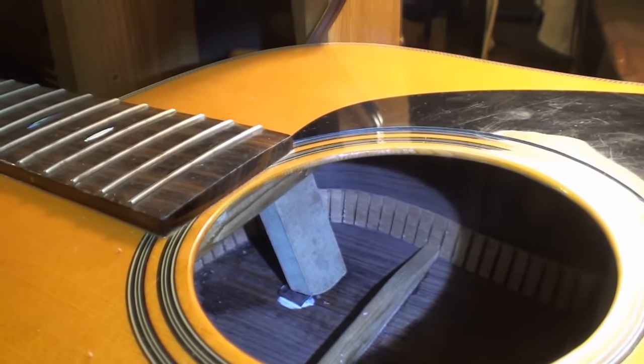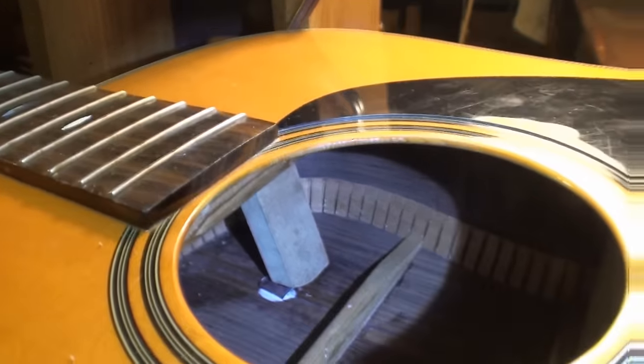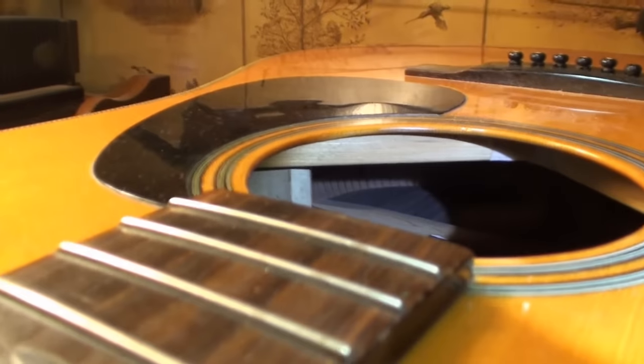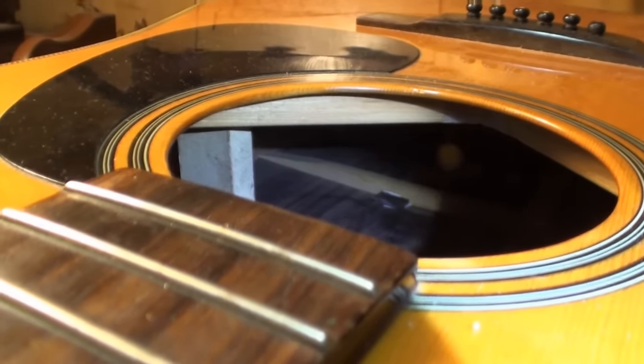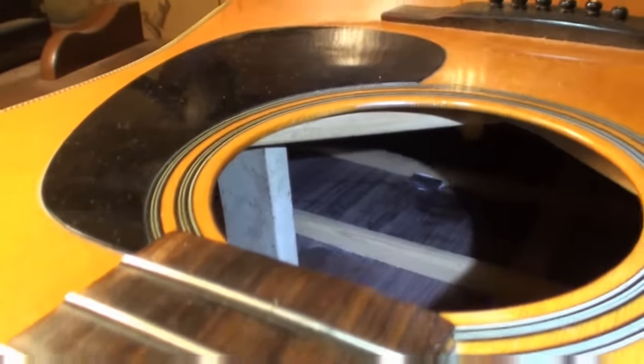We have success. I've got to wipe that squeeze-out. There's one — just wipe it out good before that sets up anymore. There's two. That's where the one crack ends and the other one goes right on back. Now I've got a cleat back there — I think you can see it. I've still got to get a prop on that, so I'm going to do that now and wipe some squeeze-out of the way.